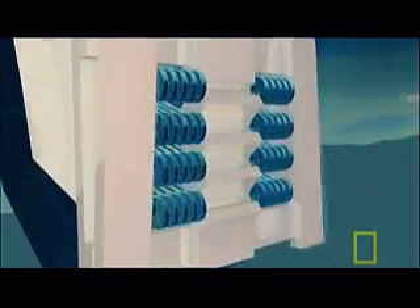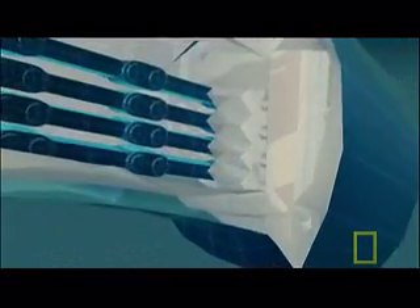To do so, workers blast their way through the rock to create an 18-metre-long tunnel. At the end of the tunnel, they position strong iron frames. The ends of the chains thread into the tunnel and are secured to the frame with 3-metre-long bolts. Metal braces wedge the bolts and frame firmly into the cavern. The only way this anchorage can fail is if the rock gives way.